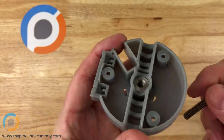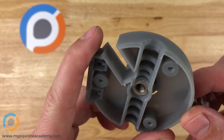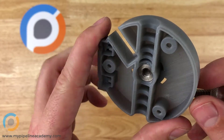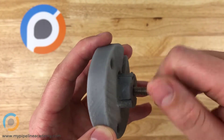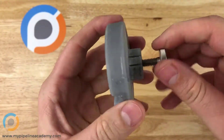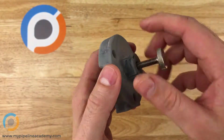So what we did is we put a threaded insert in here, and there are several types of threaded inserts. This one is a push-in style for plastic parts, and you can see the threads in there. Now when we thread our thumb screw in, it screws in just fine and it's nice and strong. It's not going to go anywhere because we have these wonderful steel threads that we have put into a plastic part.